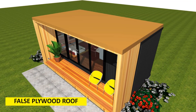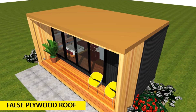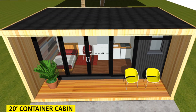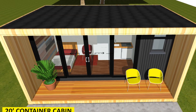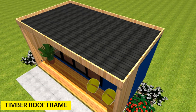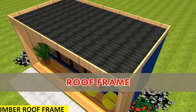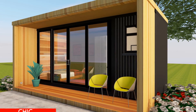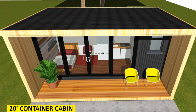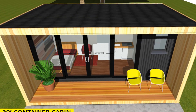To remedy this, an additional plywood roof on wooden beams resting on the four corners of the structure should be added. This extra roof should be set at a slight angle so that water that slowly filters through can be collected via a gutter on the rear side of the cabin. Remember, all timber used must be treated and waterproofed. The final bit of structure modification is to build a frame around the perimeter of the roof out of rot-resistant materials. The frame needs to be the same depth as the substrate — normally a minimum of 100 millimeters — to ensure the green roof materials remain contained within the structure.